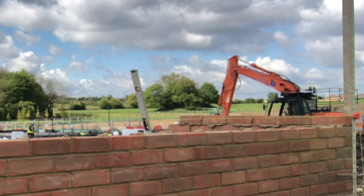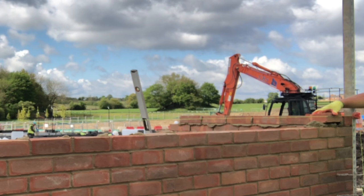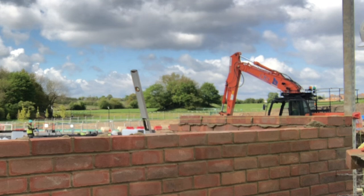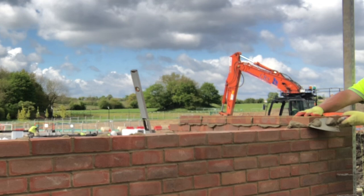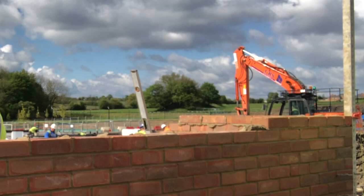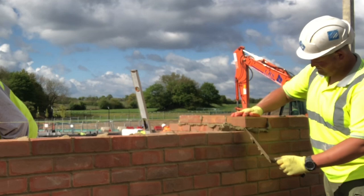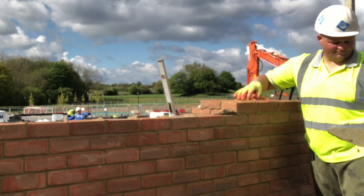Today I'm back on the profile life as usual. I was doing a spell just building corners, but I've gone back to profiles purely because I've got quicker at setting them up. I went off profiles for a while — building corners, running in, then back to building a little corner, running in, then profile on and doing 10 to 15 courses off the profile. Main reason is I've just got used to setting them up solid. If I build a six or eight course corner, I can get the profile bang on plumb without having to wedge anything behind it.